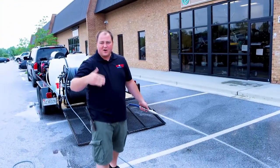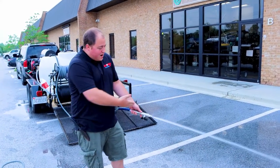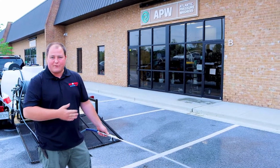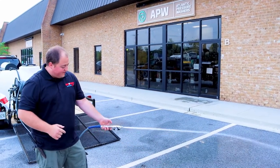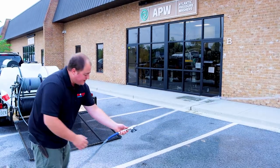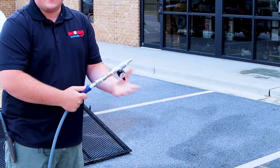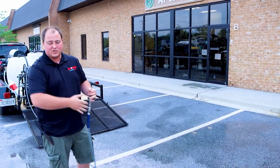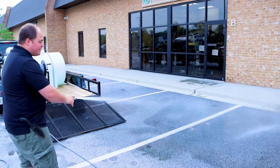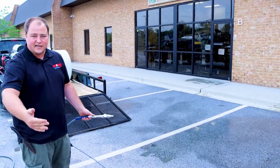The first thing we're doing is warming up the machine, letting the water flow through, making sure everything is where it's supposed to be and there are no clogs. One of the benefits of our high pressure ball valve assembly is that it can swivel even under pressure. This means that as I'm walking with my line, my hose won't get tangled up as long as I'm moving straight. It also allows me to turn our flow on and off, allowing me to change accessories.